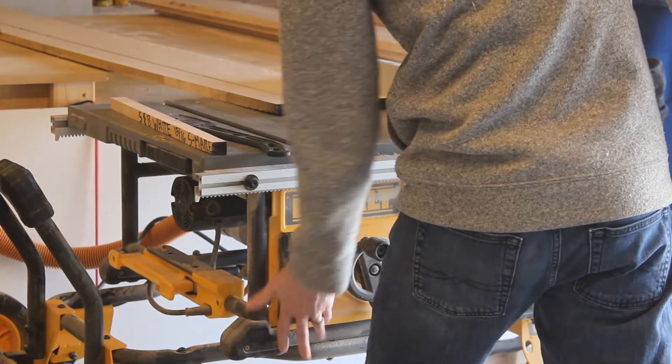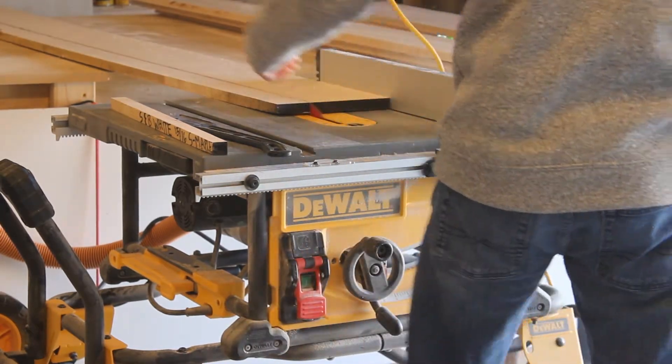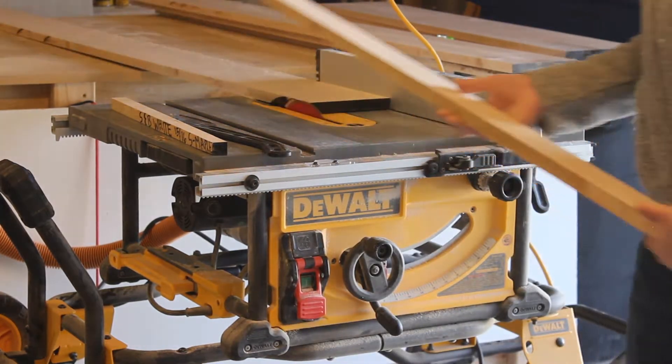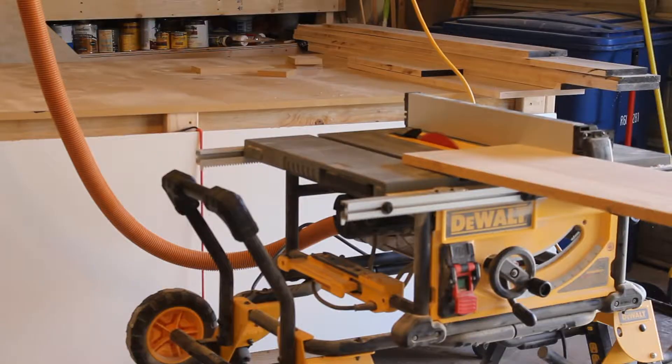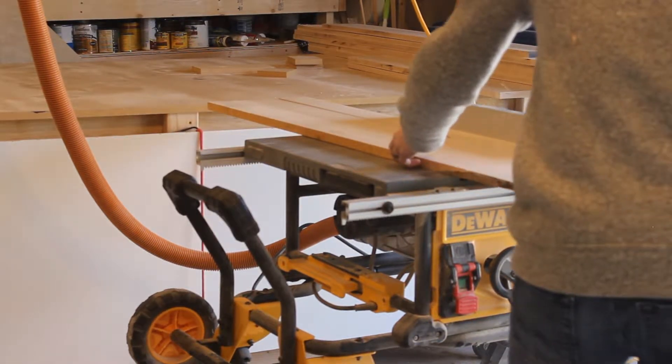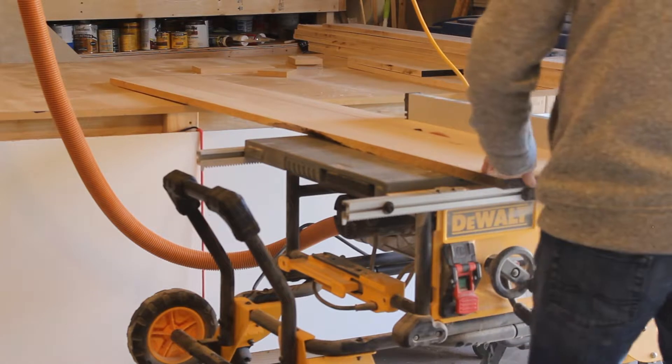It's three-faced so I didn't have to work too much with it. I sent it through my jointer and planer just a little bit to make sure it was all square and even. And then I ripped down the boards to 3 inches and 6 inches — different varying sizes that I can play around with to get my final dimensions of 24 inches on my tabletops.